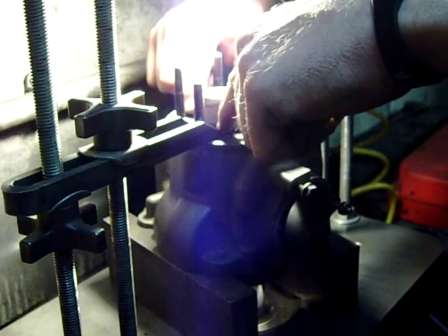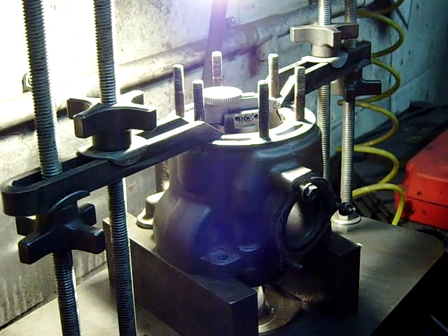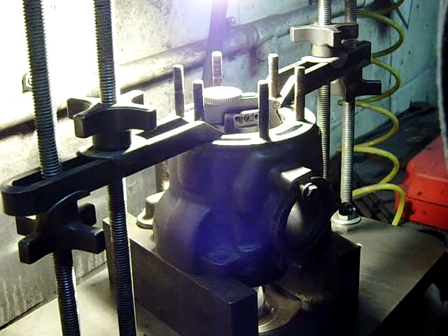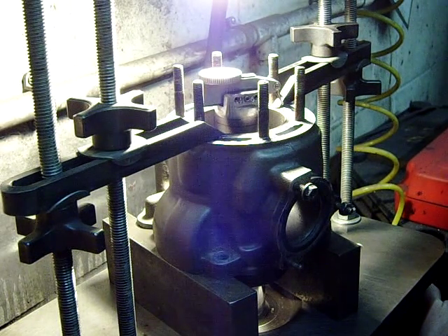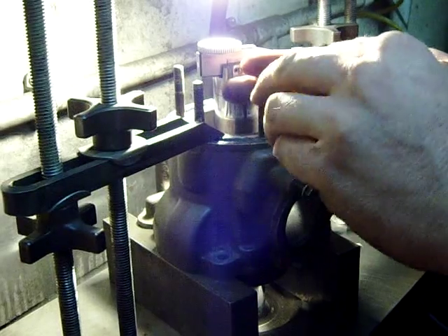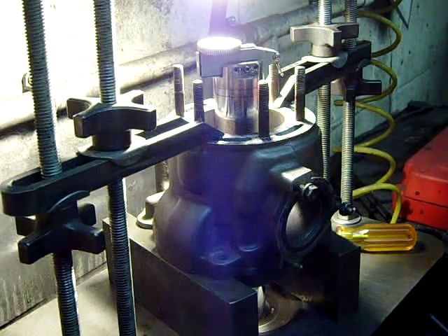It's got a spot that drops out on this side, which is a little weird. A lot of times you'll kind of get that out on the exhaust side, but this is actually back on the intake side where there's just a little drop in the cylinder. I've noticed with a lot of cylinders, if they've been bored a bunch of times, the last person might have off-bored it — bored it crooked or out of center. Harley cylinders are notorious for this because they're such a long cylinder. You'll start touching here, touch over there, and they just sometimes have weird shapes.